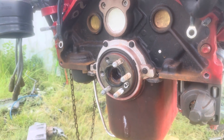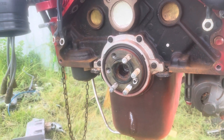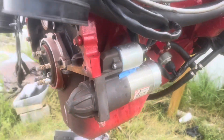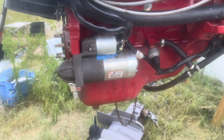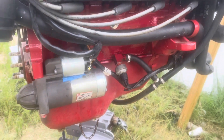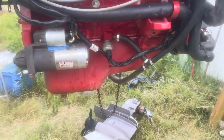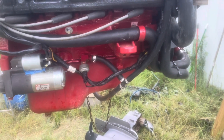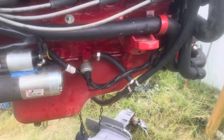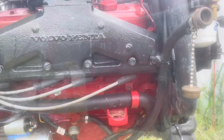Next I'll get the starter and probably the knock sensor. I kind of work my way from the bottom to the top. I'll go around this side of the block and then I'll probably get the water pump off the front and get all these hoses off at one assembly at one time. I've now removed the starter — the only wire on the starter was the yellow-red stripe, which is what engages the starter. It comes off that main harness right there by the Volvo Penta tag.